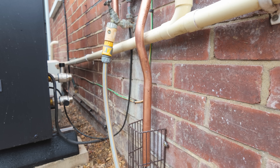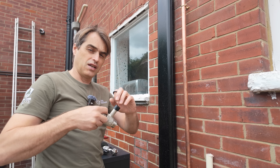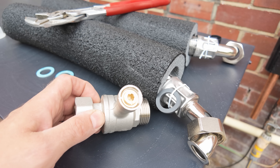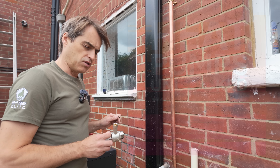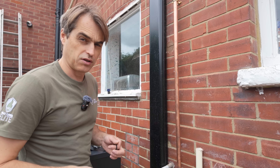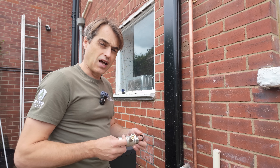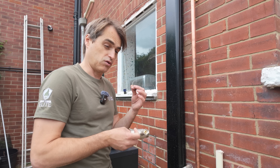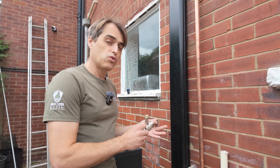We've done our D2 pipework with a beautiful offset and now it's time to connect the primary pipework to the unit. I'm using these really interesting isolation valves with an extended handle so we can insulate them nicely — and they actually need a key to operate. Thanks to James Low for sending those. We are not putting antifreeze valves on this unit and we're not using glycol. You're not supposed to use glycol with R290 units — propane needs to vent to the outside through the auto air vent if there's a leak, and glycol keeps propane in suspension and can transfer it into the property.